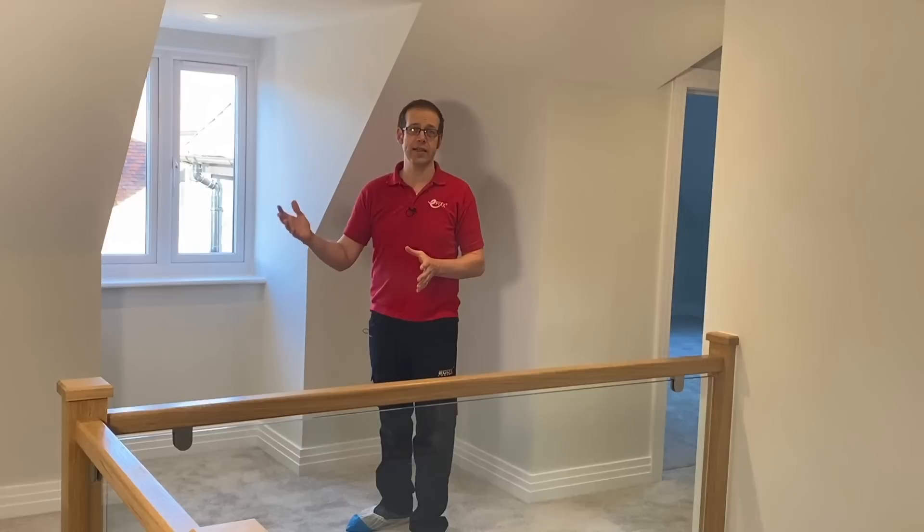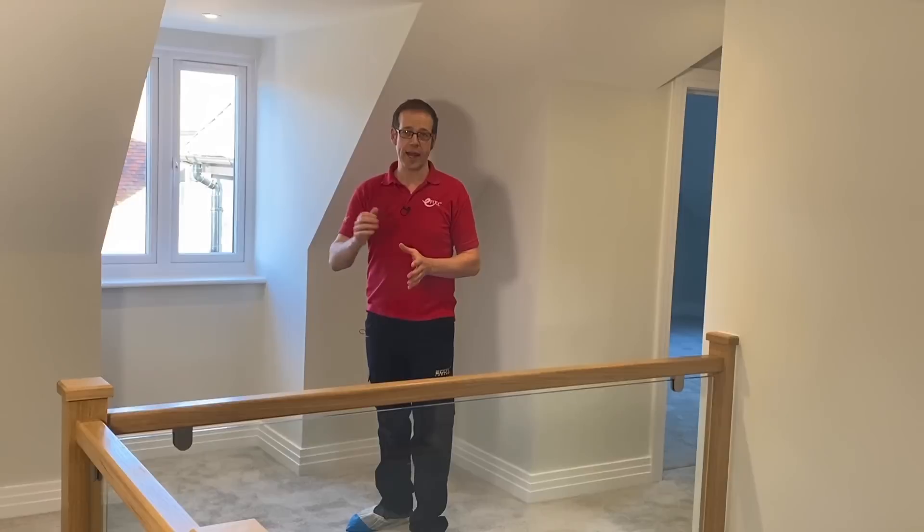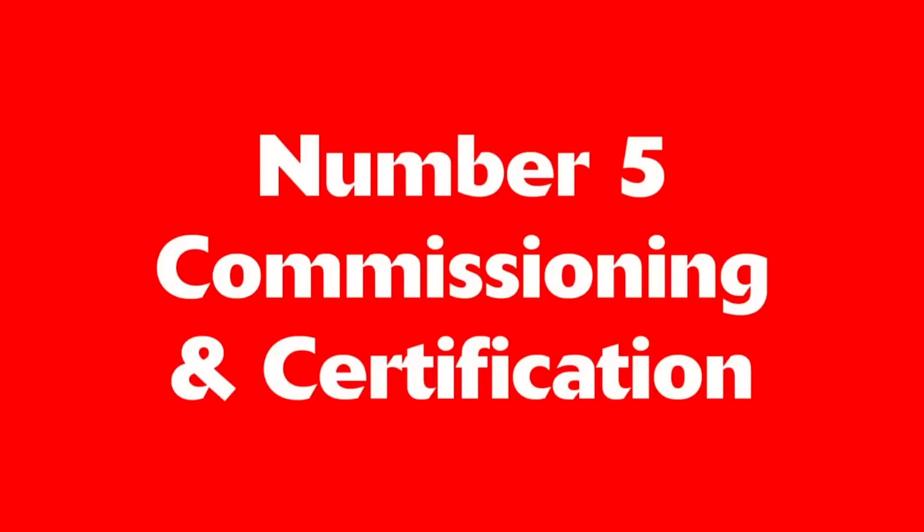It also allows for other options such as remote reporting of the status of the alarm sounders via Fire Angel Connect. Number five: commissioning and certification. For many years the smoke alarms were kind of neglected in electrical installation commissioning. Hopefully the circuit got tested thoroughly as any new circuit would, and a really conscientious sparks would press the test button on the front to make sure it sounded.